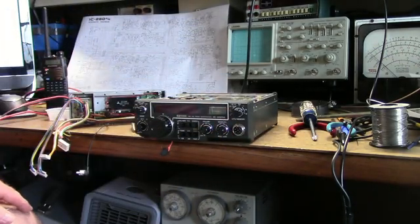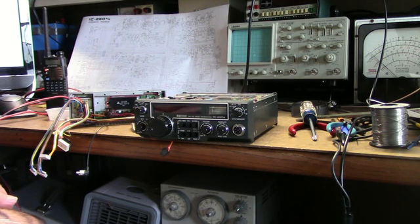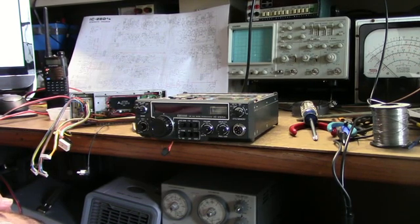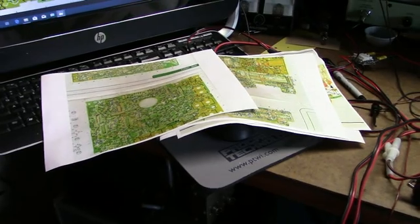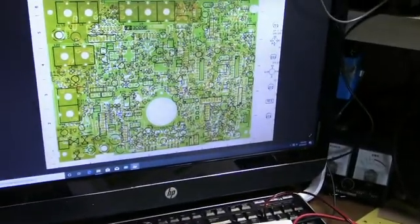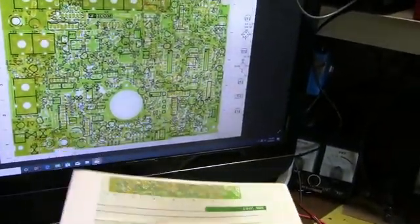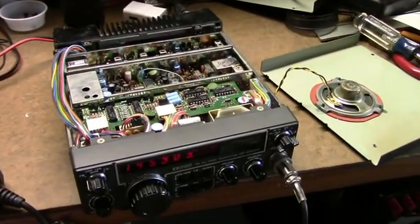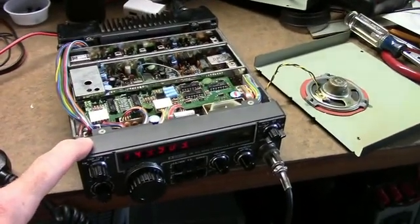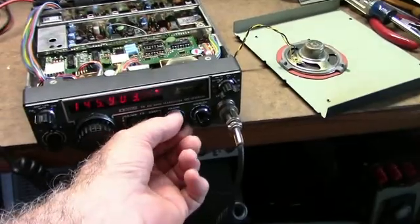Time to start troubleshooting. First we'll try to get the receive working, then figure out if the transmit power brick is bad. I'll connect the exciter up and see if I'm getting any output directly from the exciter. On the internet I actually found some guy who had posted board pictorials for this unit — and I took it apart. There was a cable that was loose underneath, so it's working now.